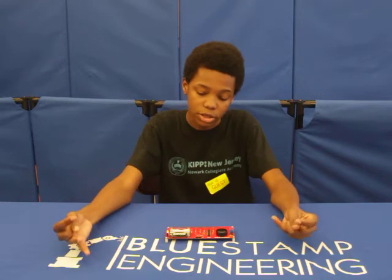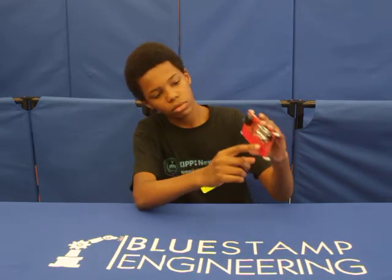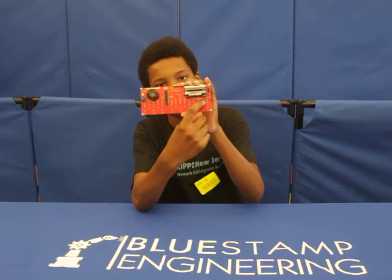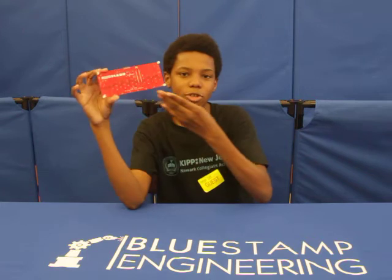That's how it works. A challenge I had was that one of my 2 mega ohm resistors couldn't be used anymore. What I had to do was replace it — I got two 1 mega ohm resistors and soldered the tips of them together. As you can see right here, this is where I soldered them. My amazing soldering skills.